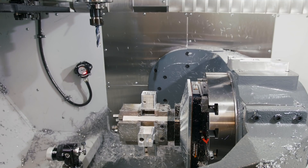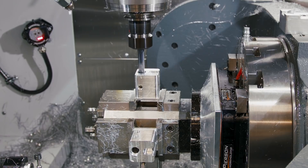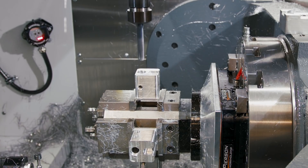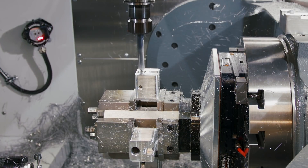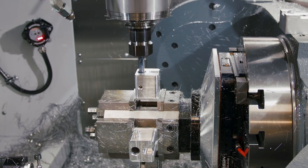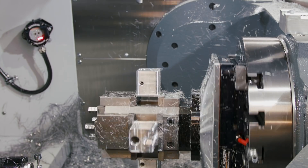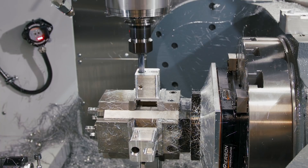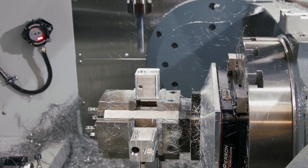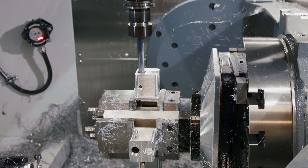Next is a 14.5 millimeter through coolant drill — a single straight plunge at about 150 inches a minute, very conservative for its size. The through spindle coolant works beautifully, blasting in and blasting out those chips. We're actually running a reaming cycle feeding in and out, which gives a really nice wall finish with these through coolant carbide drills.